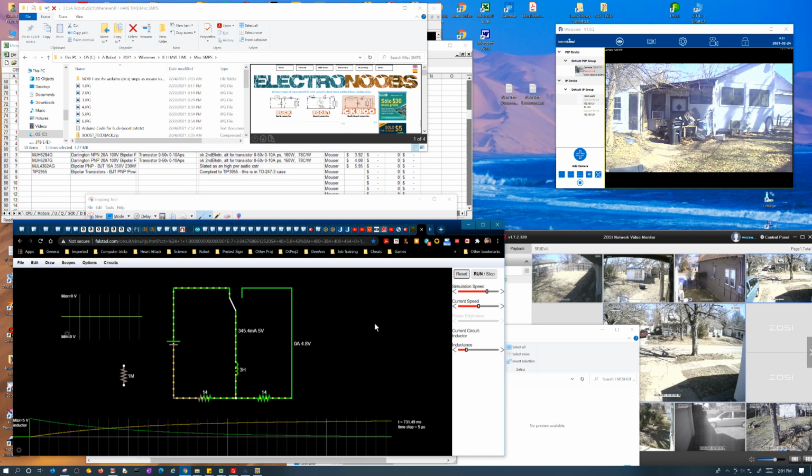If it's a 1 farad capacitor at 5 volts, it's going to store the same energy no matter what, if you leave it on long enough to charge up. It's always got that energy in it, but that doesn't work that way with inductors. Once that current stabilizes, remember before it was at 35 milliamps, now it's at 350 milliamps. So you're actually putting 10 times as much energy into this field, because it's capable of storing a lot more, based on how much current is flowing through it.